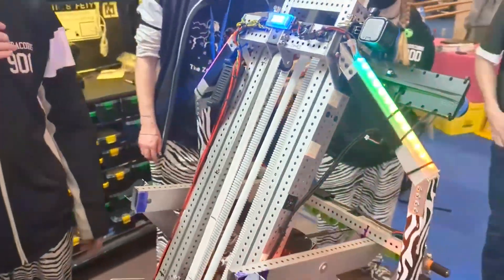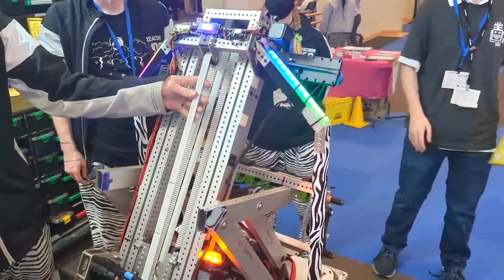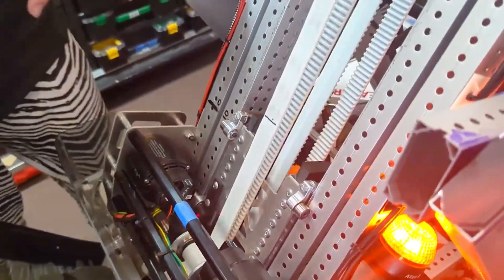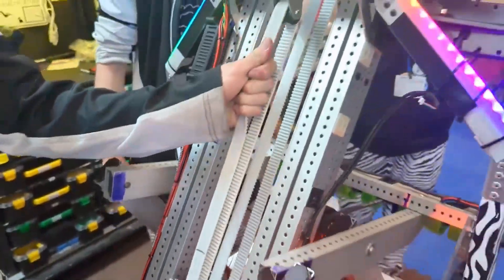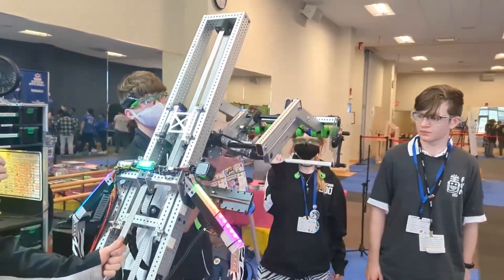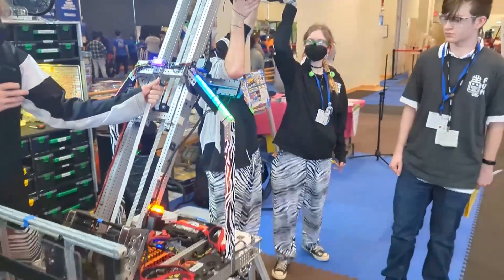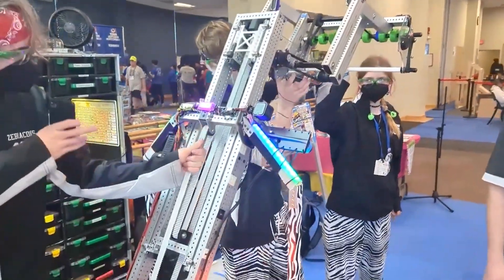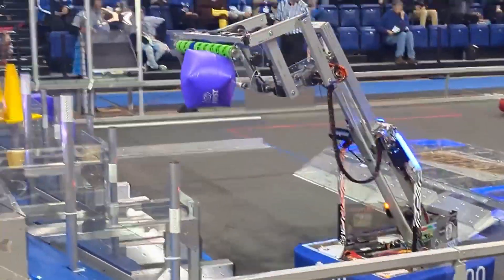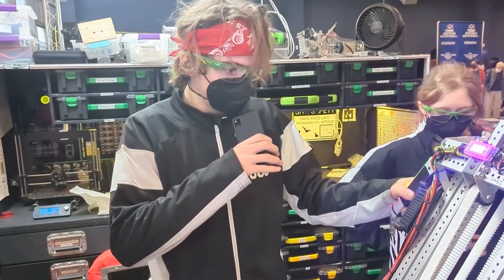Our elevator is driven by two Falcons. We actually took a lot of the parts from our 2019 bot design, and it consists of a standard HTD 5M belt. It's two-stage and we use the Andy Mark bearing blocks, which fit really well with the max tubes. It can go up, and once it reaches the top of that first stage, the second stage goes up too, giving us a max height around there. We've got a bunch of different pulleys that connect to each other and give it its two-stage nature. One thing about this elevator is that in code, we have to make sure the four-bar doesn't touch it. Like in 2019, we also used a belt.